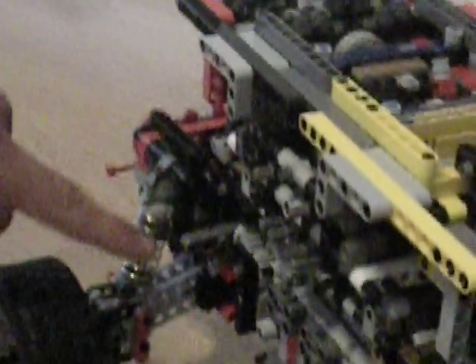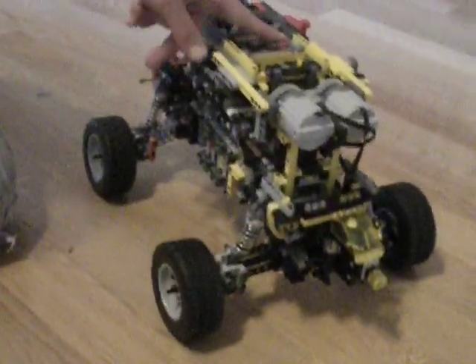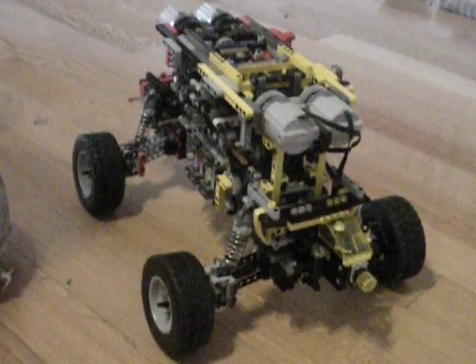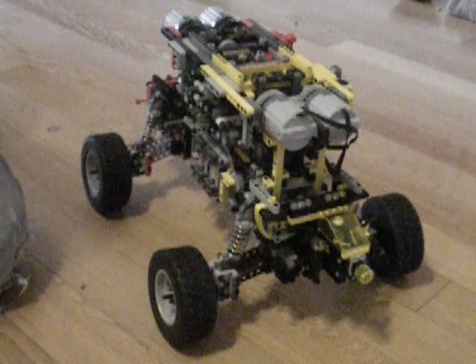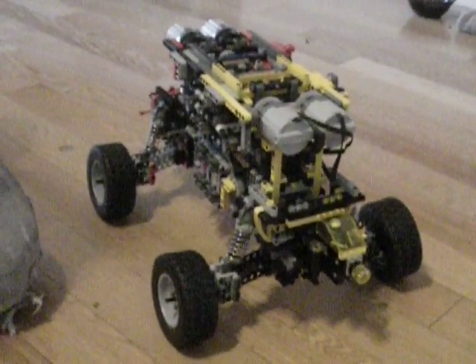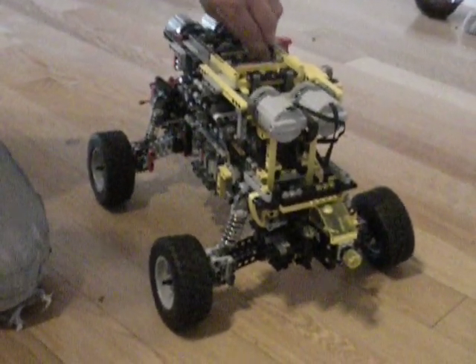Multiply down to our low range — that's a 3 to 1. Multiply down 24 to 1 in the worm gear. And then another 3 to 1 in the hub. That's what gives us this really slow cruising motion. This is sixth gear — you can hear the engine struggling a little bit more. This is one of its faster speeds that it can handle, though obviously not that fast. A lot of energy is lost in the complex transmission.